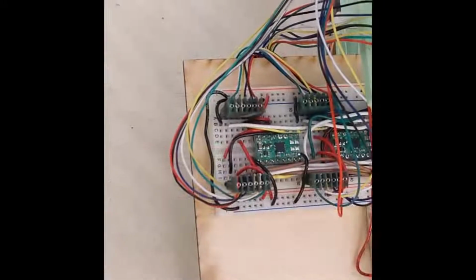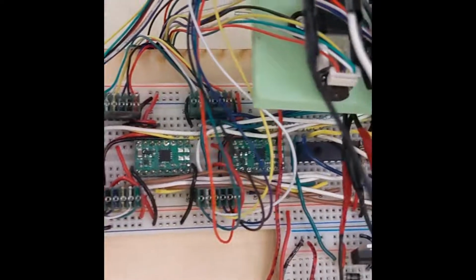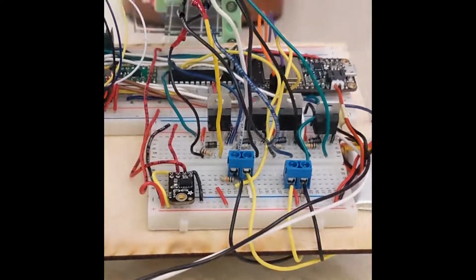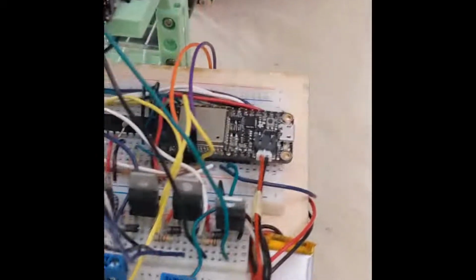We use 2 motor drivers and 4 encoders to actuate our motors to the desired fret position. A buck converter is needed to step down the 12-volt power supply that we use for our solenoids to the 5-volt power that we need for our motors. Additionally, transistors are used to regulate our solenoid voltage.